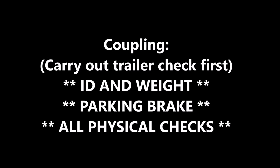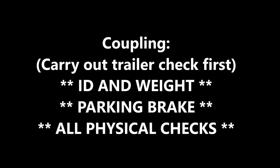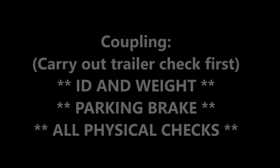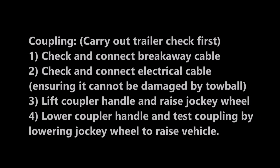Once you're happy with the trailer, we're going to reverse towards it, stopping far enough away to check the height of our coupling. Once we're happy with the height, we're going to reverse the tow ball underneath the coupler. We're going to stop there, apply the handbrake, select neutral, switch off the engine. Now we go into our coupling procedure. So at this stage we're going to check and connect the breakaway cable first. Remember, that's always last when we're uncoupling, first when we're coupling.